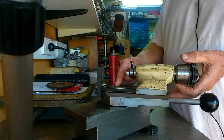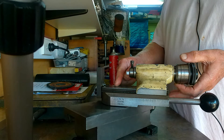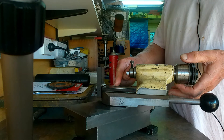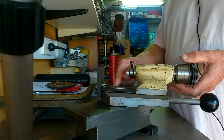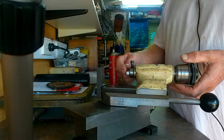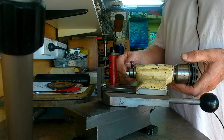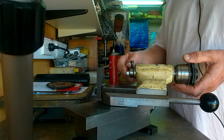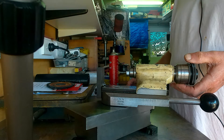In this instance I'm going to demonstrate turning what was going to be a one inch ball, but the material is only 2 thou over so that may not clean up. So I'm actually going to machine the ball to 950 thou diameter. What we need to do is put slips in between there to the value of 2.225 — that's 2 inches 225 thou. I'll get some slips out and show you how we're going to do that.